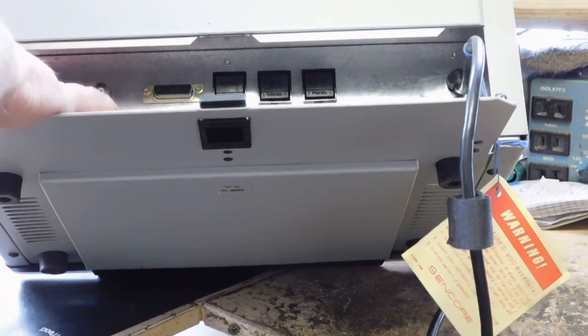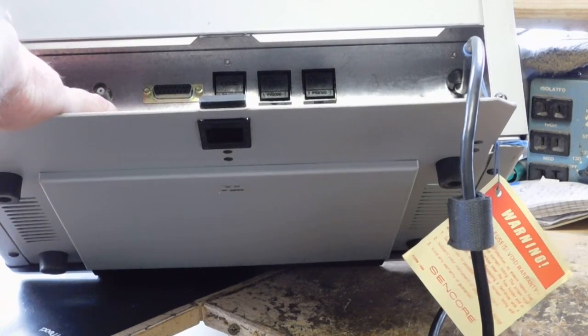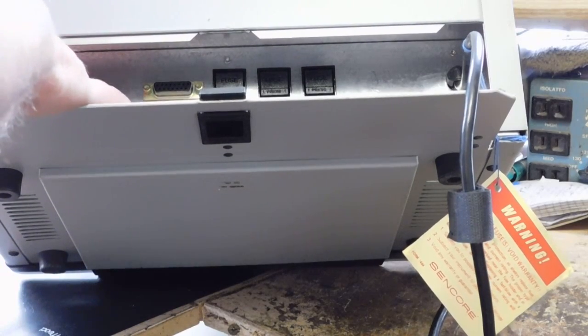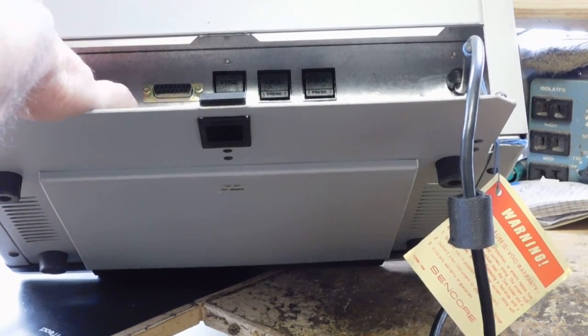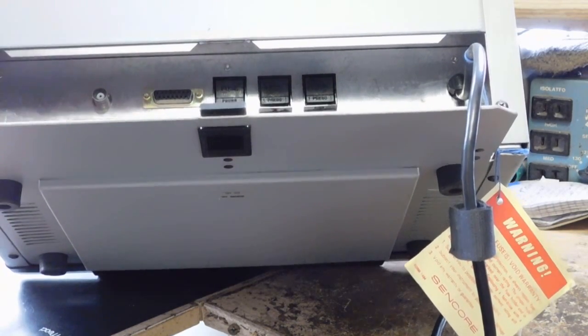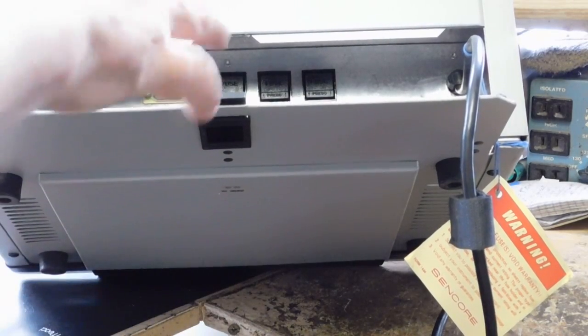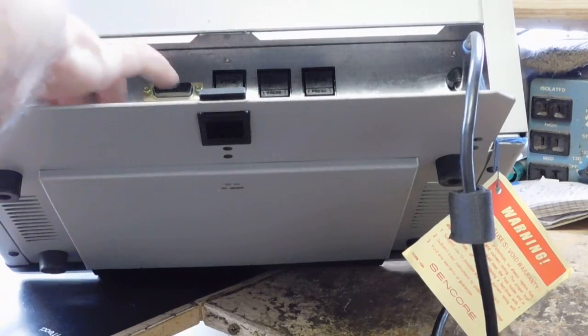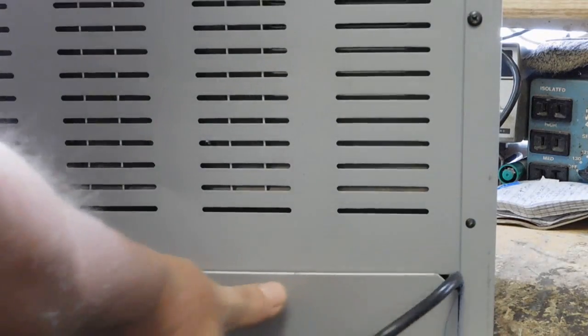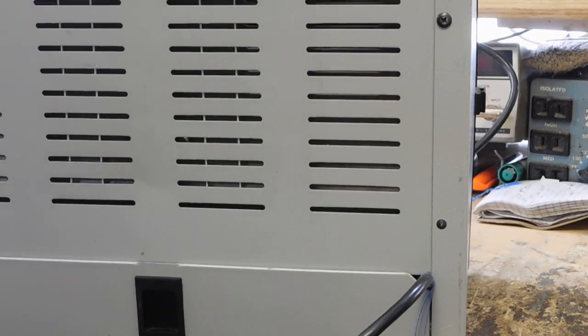And then this is the input for external modulation, video modulation, negative sync, from 0 to 4.5 megahertz, and composite video. It can be plugged right into this jack. So if you wanted to use the IF frequency or something, and you needed to modulate that, this is where you hook it on, back here for an external modulation for that frequency. And then of course this closes. This is also where all the other leads would be.